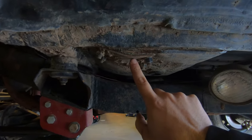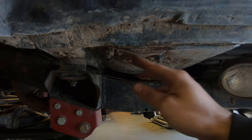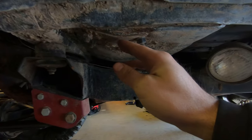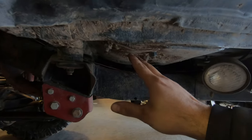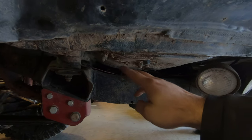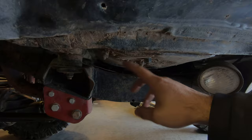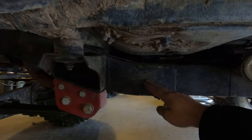This plate right here is where the roll cage mounts and as you can see it's bowed out. Based off of how crunched up this thing is, it's been rolled over before and the roll cage tried to push down. Luckily it didn't go through the floor, but I want to make sure that can't happen, so we're going to be adding some tube from the plate over to the frame — pretty simple there.